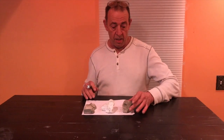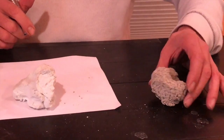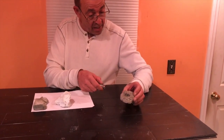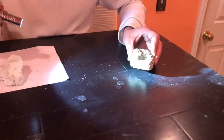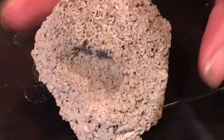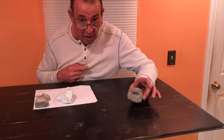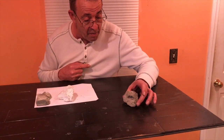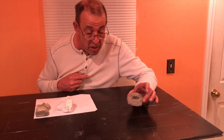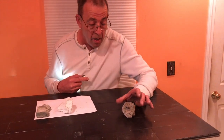We'll start with the easy one first — the cementitious material we poured with the aircrete foam, which we'll call Aircrete C. As you can tell, it's fairly hard. Evaluating it, I can see it's got a very porous material and it's very light. R-value wise, it's typical for a cementitious block with aeration — it's basically designed to make a lightweight cement, which it achieved. I can literally blow through this and run water through it like a sieve. So R-value: not much. Lightweight: yes. Structural strength: not so much — I did break a piece off, so it's in a mediocre range.